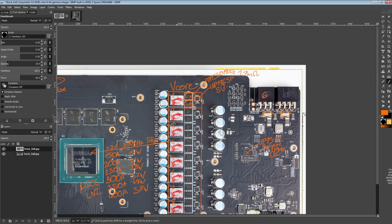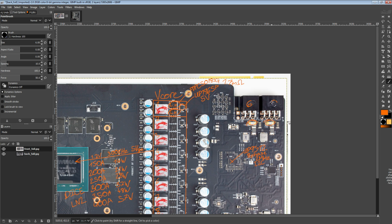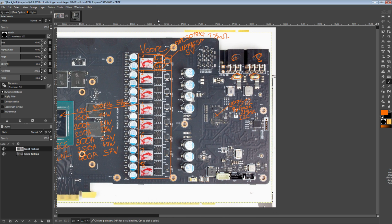I actually ended up confirming that, because I basically ran a dual PSU setup with one PSU powering the GPU. Otherwise, the main issue is the ground of the motherboard is shared through the PSU with the ground of the GPU. Well, it's all one ground basically, between the power supply, the motherboard, and everything. And if you use 2 separate power supplies, it's not really a separate ground, but it basically forces the current to return to one PSU instead of through whichever random path it can find to the first one. Right? I really didn't explain that well.